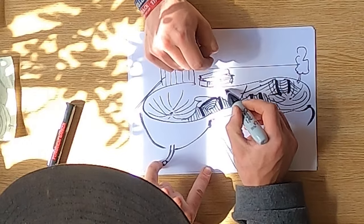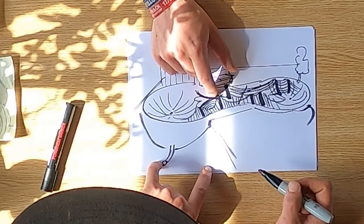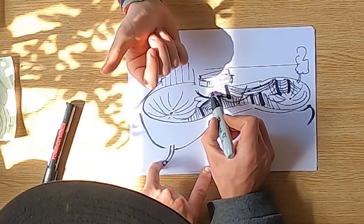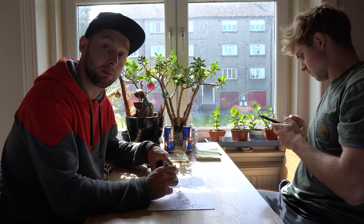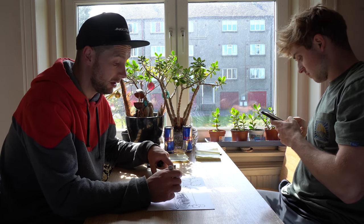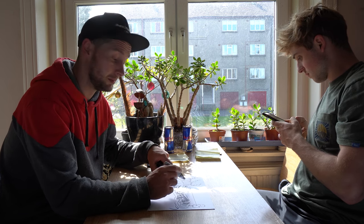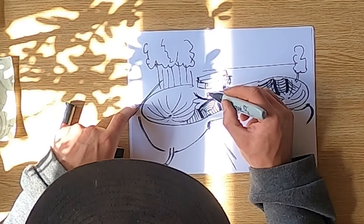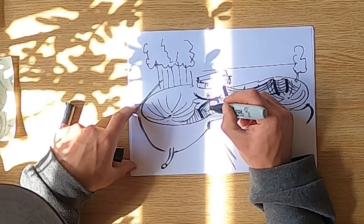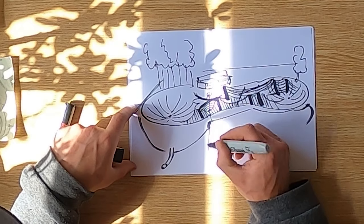So the high point is probably about here. If that's your high point, your low point is going to be in the corner. In the middle here? Yeah. So that creates a bit of a problem for us at the back, because it means that there are then three or four high points around that spot there, so we're going to have to drain it. We're going to have to put a drain in at that point there that will then drain through the love heart shape and out the low point of the berm and drain out of here.